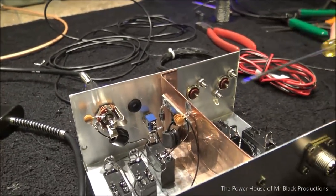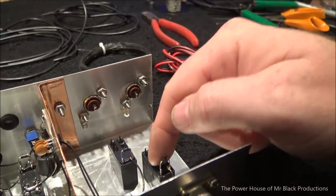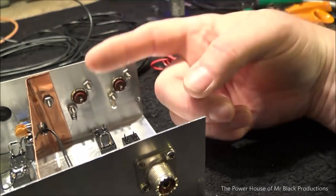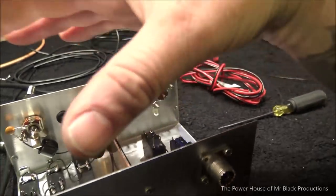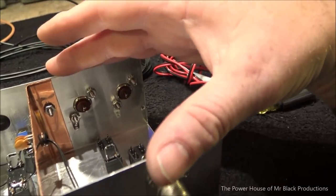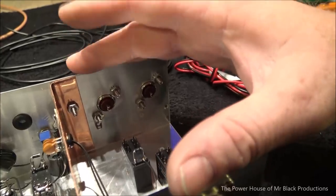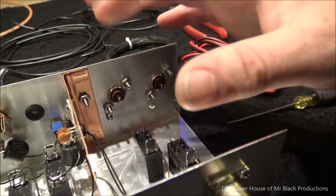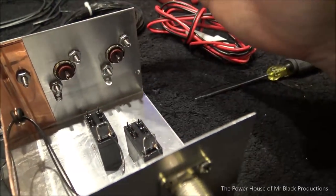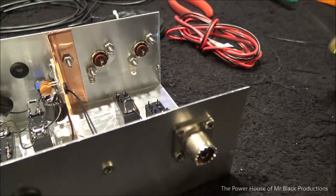Okay, so moving forward, already on this way too late overthought process, let's go wire the actual Dow-key, these two relays up. And in theory, really for a Dow-key, all you need is one relay. It's because we're tying all this expensive radio equipment over here on this side into the circuit. We really can get away with just switching the antenna over here. But if you wanted to just have this basic of a switch, you could literally go buy this box with a way substandard relay in it from MFJ, and it'd be all plastic and leak RF and leak signal and metal. There's a reason we use metal.